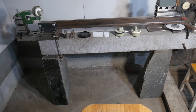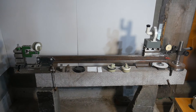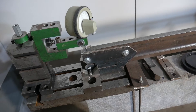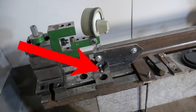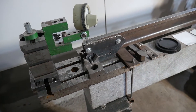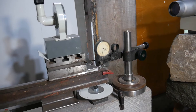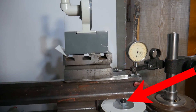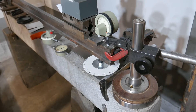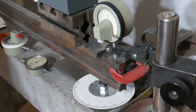The stand is a rigid support with a 1000mm straight edge on top. Granite blocks are glued in certain places to prevent movement. To control the immobility of the left edge, a micron comparator is installed. The right edge can be raised or lowered, controlled by a micro lift, and the movement is executed and monitored with an accuracy of approximately a tenth of a micron. I carefully turn the micro lift disc and control the ascent or descent very precisely.